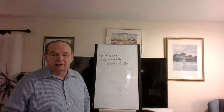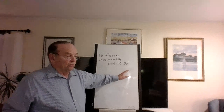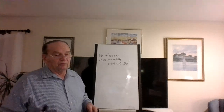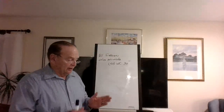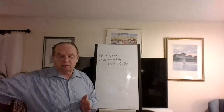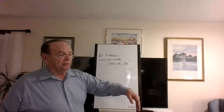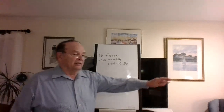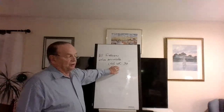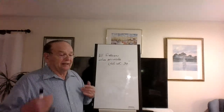So this is the minimum. So that'd be 15 on center. Okay, 15 on center. If you've got the room, you got plenty of room. My advice is to go 18 inches, and I suspect that most of you guys do that anyway. 18 inches from the center of the bowl to the wall, and then whatever's on the other side. If it's more than that, no big deal. I mean, you don't want to go any more than 18 anyway. You don't want people having to reach 3 feet to get to the toilet paper on the wall. So 30 inches is by code. That would be the only measurement for accessibility that I can think of.